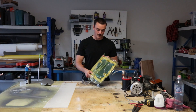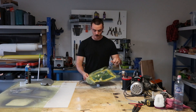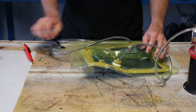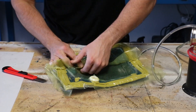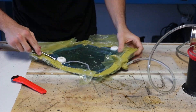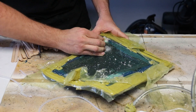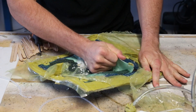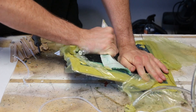The carbon fiber piece is ready to demold. You can tell because the resin inside these tubes is really brittle and easy to crack, so it's ready. There are really no tips or tricks or gotchas to the demolding process — it's just a matter of peeling everything off and revealing the carbon fiber underneath.